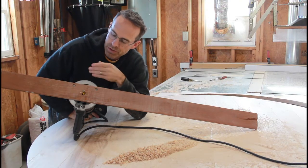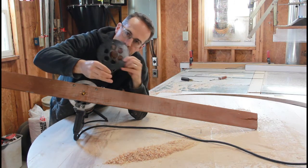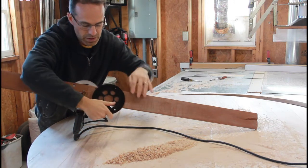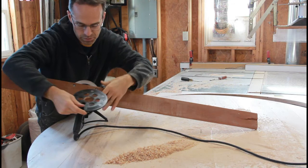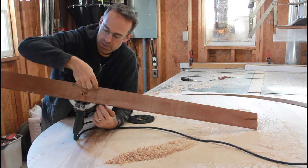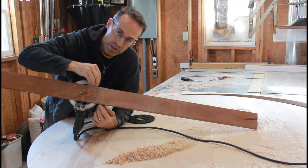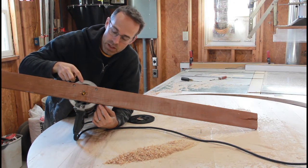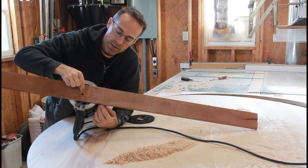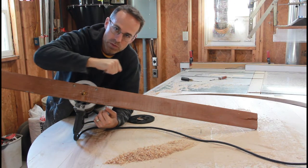Zooming in a little closer to show the setup and how it's hooked to the router: I took off the base plate, which was attached with three machine screws. Then I took the base and traced on this board where two of the holes lined up — since it wasn't wide enough for all three, two was enough to hold it in place. Then I drilled some countersunk holes so I could get these little screws through this board into the actual metal base of the router. Then I plunged my straight bit through the piece of wood about a quarter inch to start with a quarter-inch pass all the way around.